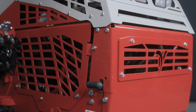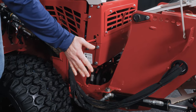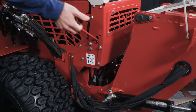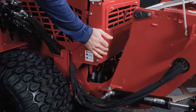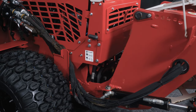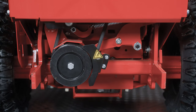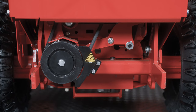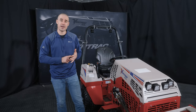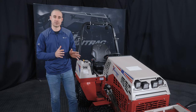One thing to pay attention to is the actual force that it takes to push this lever in once the belt is connected. So you'll see here, it takes a little bit of force for me to do. It's pretty easy, but then it kind of snaps into place and it has a little bit of tension there that doesn't want to let it pop out all by itself. And that's in the appropriate place. But if you start to notice this get too loose or too tight, then you'll want to make some adjustment to that PTO. And the way to do that is back behind here, there's a couple bolts you have to manipulate. That procedure is in the operator's manual. We're not going to go into that for this video, but just know that it is there and sometimes does require that adjustment. Where that is important is if you are suffering from shortened belt life, that can be one of the culprits. So if you don't have enough tension on that belt, then it can be slipping and shortening the life of your belts tremendously.